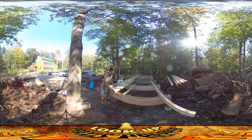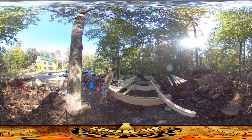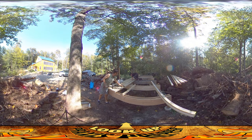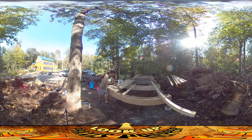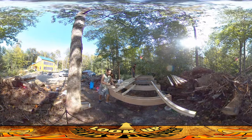These boards are two-by-threes, like I said — they're eight feet long. I wasn't able to get anything longer; I guess it's kind of rare to even find them longer. I'm able to get a maximum of two of these bays out of each board. I'm lining this up with the line I put down over there, and then I'm using this to sink it almost another inch, so we get about two inches of penetration down into the wood.